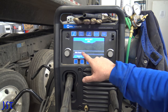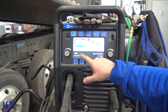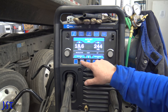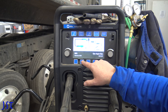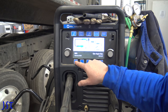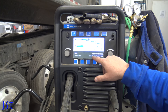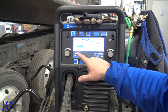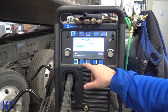You can also go to different steels. This is mild steel. You can also do mild steel 100, which is just a little bit harder material, and it tells you what gas to use. You can do some aluminum using argon — I've never tried that but that's going to be cool. You've got aluminum 5x. You can also do stainless using a trimix gas. It's pretty cool. You can also use gas-shielded flux core and self-shielding flux core.